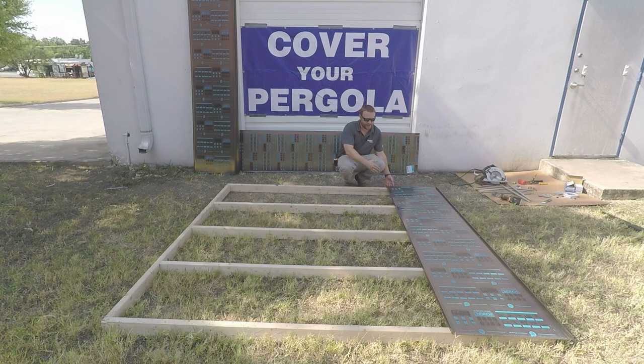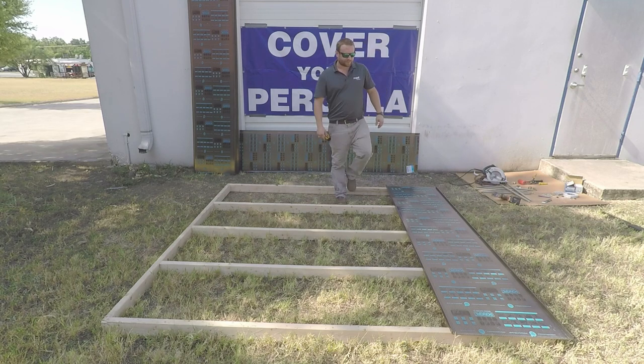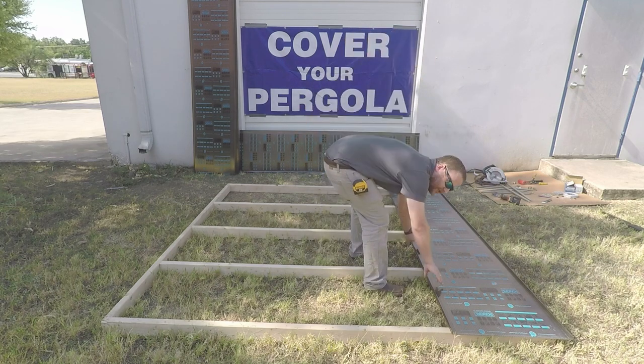This structure is square, but we're going to start from the middle anyway. If you have a square structure you're welcome to start on one end — trim off the U-profile on the side of the sheet and start from the end. This is installed with clips, and we have sheets pre-cut to the needed length with one inch overall overhang.